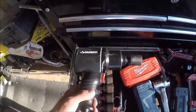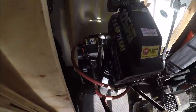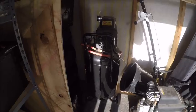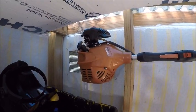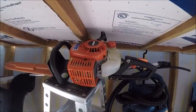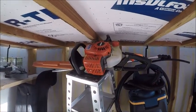I've got the air gun for when I'm changing my blades, and the compressor I use — another Harbor Freight tool. Originally I bought a smaller one for changing my blades and then realized it wasn't enough CFM to power my air gun, so it sucks to buy the tool you need twice, but live and learn. I still have some of my Echo tools — this P225 runs but has had some problems. I replaced the carburetor, spark plug, air filter, fuel filter, and fuel lines. Here's the HC 150 hedge trimmer I was talking about earlier, just sharpened the blades. I'm selling both of these if anyone in South Florida is interested.